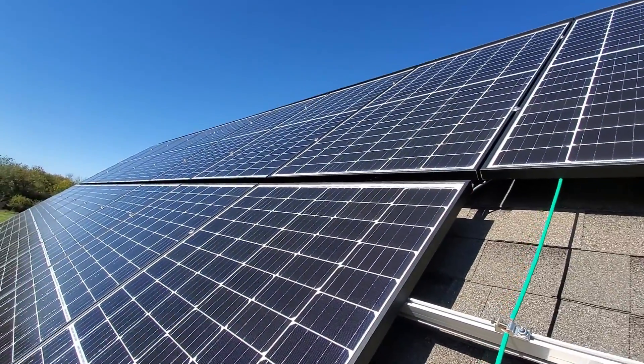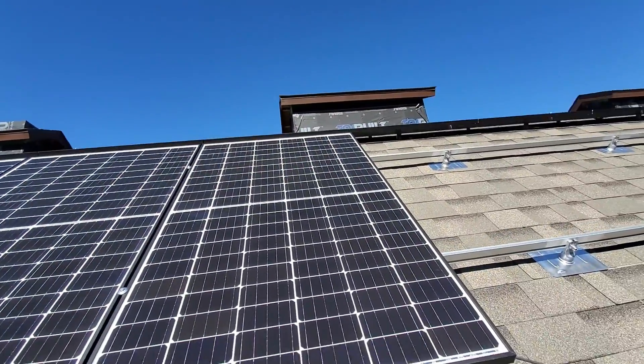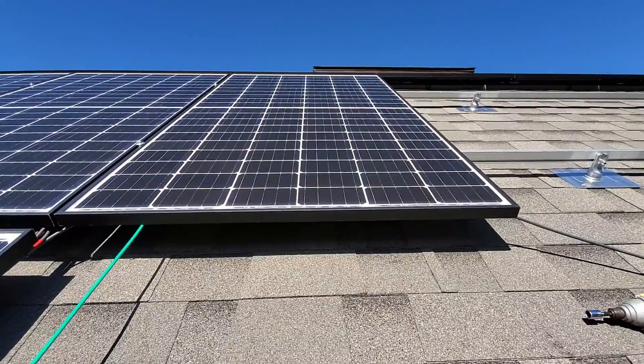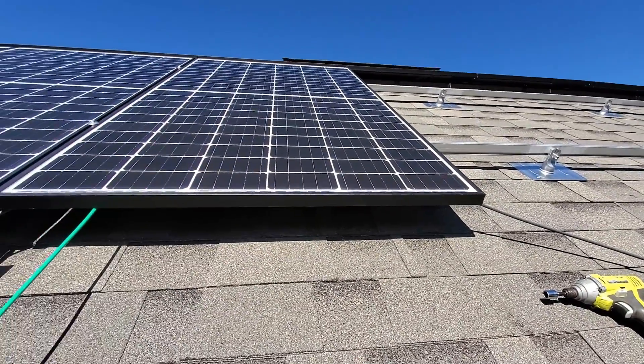I'm going to head down and get 3 more panels, and I've also got to go inside and pull the wires I just ran for 3-2 through my combiner box and get all those situated. I've already put 9 panels up this morning and I've only been up here for an hour and a half maybe — so I was flying pretty good. Yesterday I had the family helping me, and my daughter up here helping me put the panels on, and I think that gave me enough time to figure out a good method for doing it by myself. When her and I were doing it, we did 3 panels in a row starting at the top and working our way down. This time I started with top panels and did the whole row, now I'm doing the second row all the way across, and I'll do the third row last. The middle row is the biggest pain, but I've got one panel up and only 7 more to go.